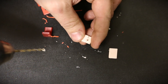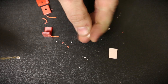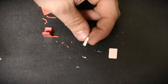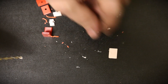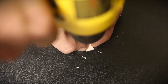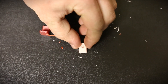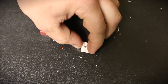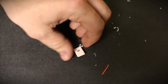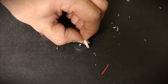The PLA surprisingly took a lot more effort to get through. I think it's a little gummier than the ABS. I ended up drilling two holes in this piece trying to get a nice clean hole all the way through, and it did crack along the grain. The thing about the PLA is I had a hard time even getting the bit to bite into it — not because it's hard, but because it's so sort of oily. It may be good for making bearings or washers, but it's not particularly good for machining.